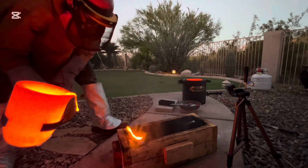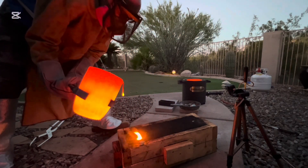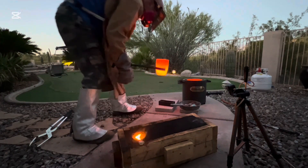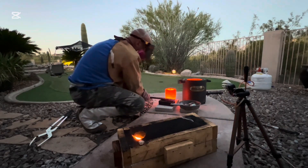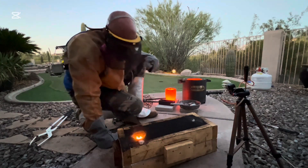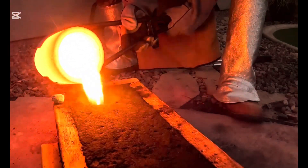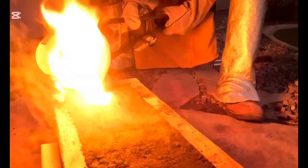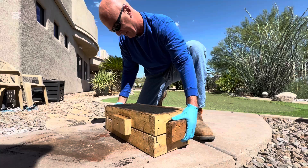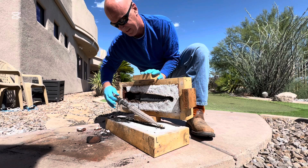After I got done pouring, I was actually quite concerned because usually I like to see excess metal bubble up through the vent. When that didn't happen, I was concerned that either the metal was too cool and solidified too quickly or I had poured an inadequate amount of metal. When either of those two things happen, it will wreck the entire project, so I always like to make sure the metal's hot enough and that I cook up enough of it. There were gases emanating up from the vent hole, but no metal came up through there. I wasn't quite sure how this was going to turn out, but I let it cool overnight — I especially like to do that with bronze because it'll get super oxidized if I pull it out of the sand when it's really hot.